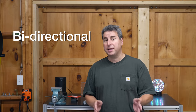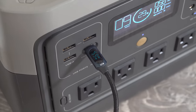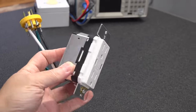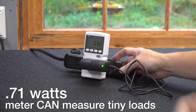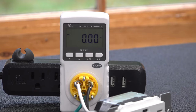This 100 watt port is bi-directional — that means it can output power and you can also charge this device. Within just a few moments you can see that it's ramping up to about 57 watts, and if I look at the charging cable display itself, the River Tube is probably using a little bit as overhead to charge the device. As for how much power these chargers use when you're not even trying to charge a device — are they going to increase your electric bill? To get that answer I've put an ad hoc plug in the end and plugged this into an external power meter so I'm able to measure how much power this outlet is using. This is great news for this Leviton outlet because this test shows that it does not consume any electricity without anything being plugged into it.